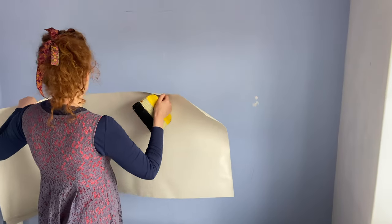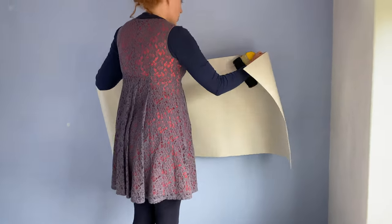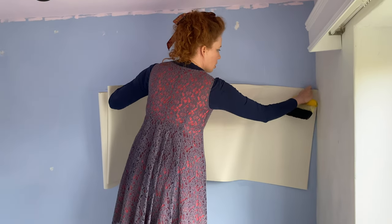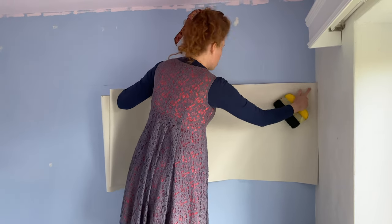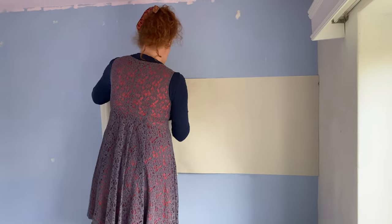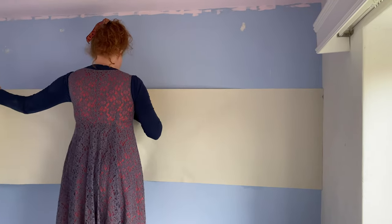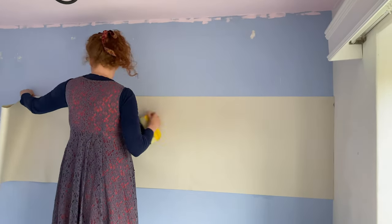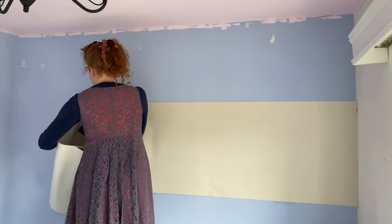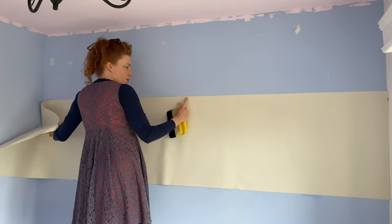Now I'm ready to put my piece of paper up — it's just been soaking for a few minutes. I've got a platform so I can easily work from that. I'm going to line this up with the line I drew on the wall, so it overlaps a little bit into the corner. I'm putting the top edge of my wallpaper against that line. It doesn't have to be exact — after all, this isn't our top paper, this is just our base coat, so it's good practice. I've got a bit too much extra — I'll just cut that off and make the next piece shorter.